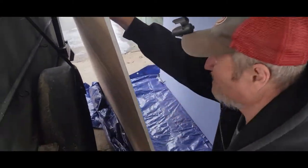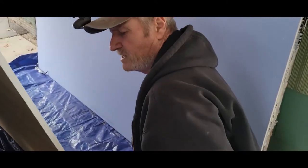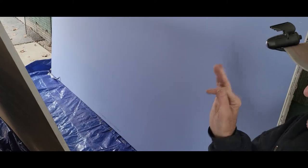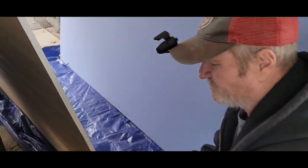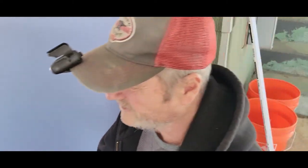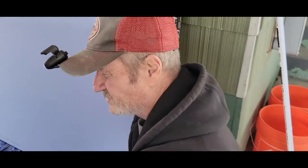So we cut the board. Now what are you doing? I'm giving it a little inside taper to where this line is flushed up against whatever you're going up against. Because when the boards break they break uneven and a lot of it protrudes out right in the center. And your cut is off too when you break them — this just straightens it out.